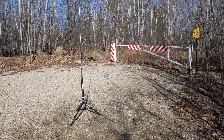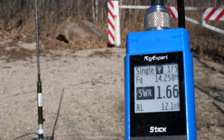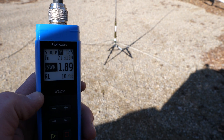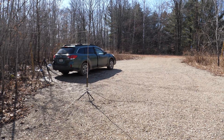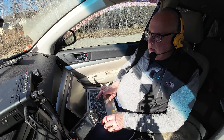Performance of the Stinger Kit is good. Using the 58-inch whip on the Chameleon PRV antenna, I was able to get the SWR down to about 1.5 to 1 on the 20, 15, and 10-meter bands. Chameleon states that a tuner may be necessary for 40-meter operation in this radial configuration. On-air reports were good on those bands.